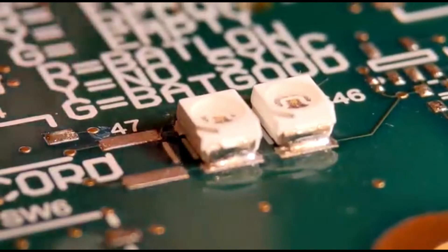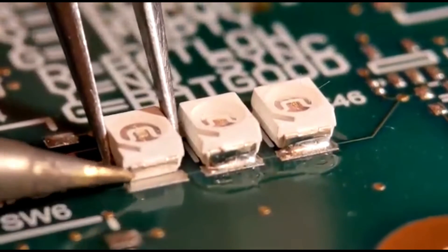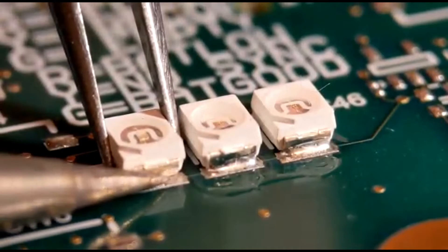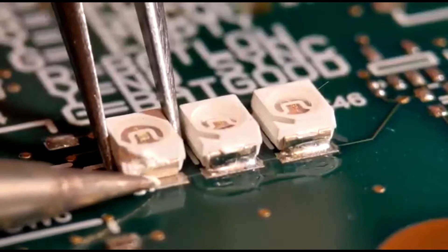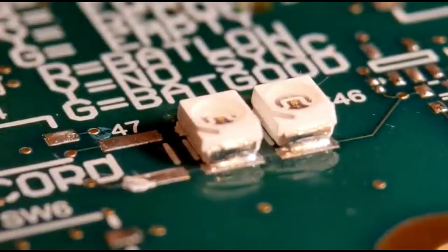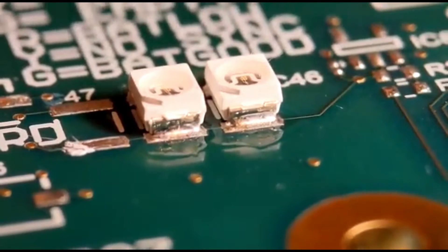This is just for the video — if I hold the iron on there, you'll start to see the plastic begin to blister. I can already see it going around the corner — it's very soft plastic, as you can see. So the main thing is: get your iron in there really quick and you're safe. That's basically the way I do my LEDs with the soft plastic body.